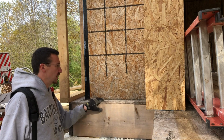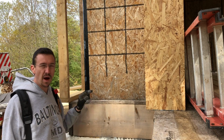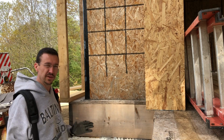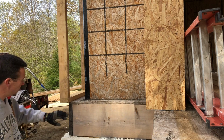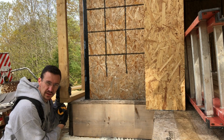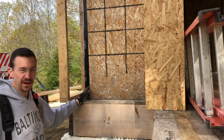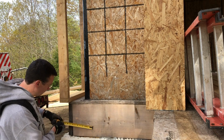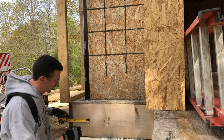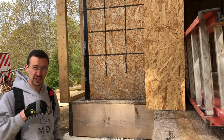So, what I'm doing here is building walls. Now, this is probably not applicable to anyone out there in the world, but I'm still gonna do a video on it. So if you see this here, this outside wall is just barely sticking on this. And the reason for that is my inside wall is load bearing, right? So I have 8 inches of foundation starting at the rim board. And so this wall here is sitting directly on the foundation.